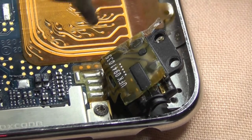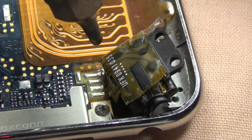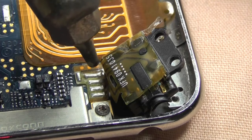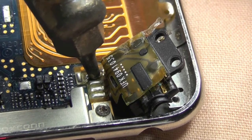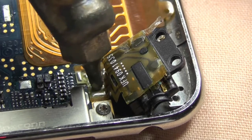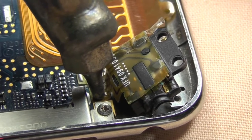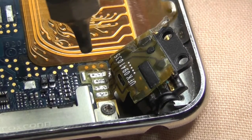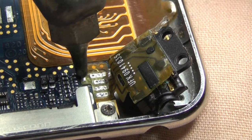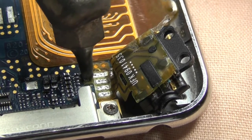It means you have to keep applying heat, and heat is an enemy of a board - too much heat is the enemy of the board. We need to be in and out, and as you can see with this desolder gun we're in and out. This is ramped up to 400 degrees and basically as soon as I see that solder melt, I'm off the board.